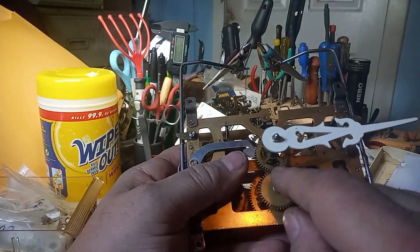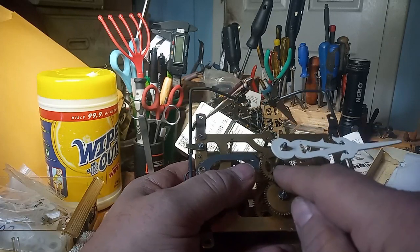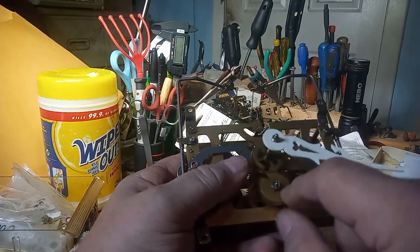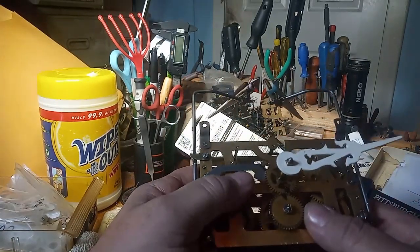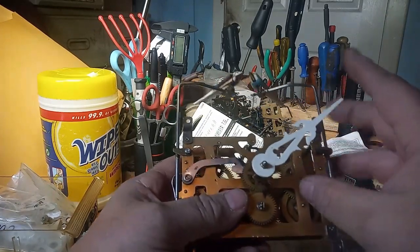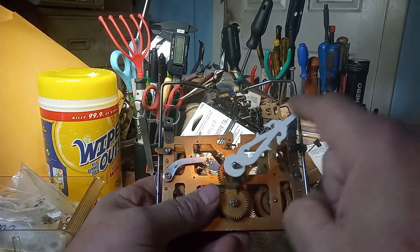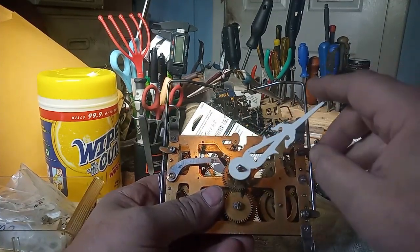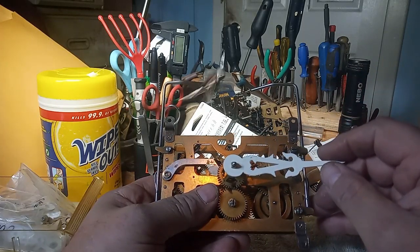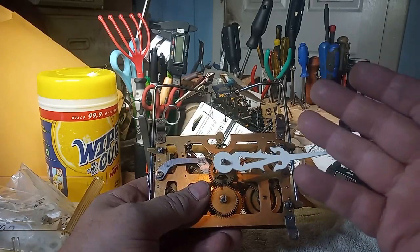I've got black marks — a permanent marker — on this minute wheel pinion, this minute wheel gear that goes through the movement, and this minute wheel with minute pinion. So first of all, we're going to move this back up, and I want you to watch this lever right here in the minute arm when it trips. It trips around 14 minutes past the hour.